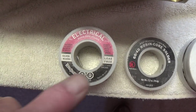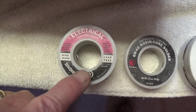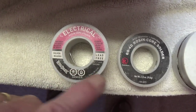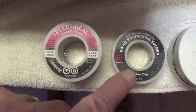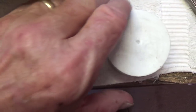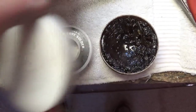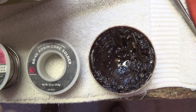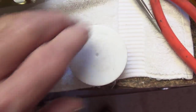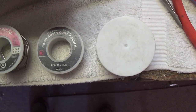If I want to solder two pieces of metal together, I would probably use silver solder. You're free, of course, to use whichever one you like. If lead makes you nervous, by all means use the lead-free. You're also going to need a type of soldering paste — it's a nasty-looking, sort of beeswax-looking material — and this really aids in the adhesion of the solder to metal.